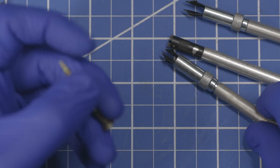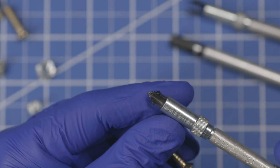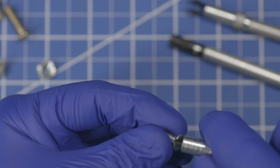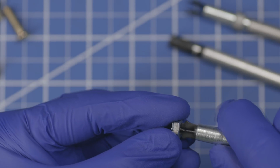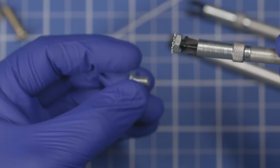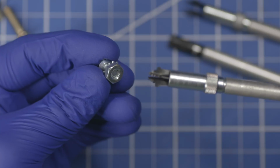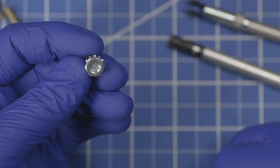That's where you want to use this design, which, as you can see, is stepped. And this is a screw and nut starter, because that step design both allows it to grab in the head of square drive screws, Phillips head screws, as well as grabbing onto these small nuts. And it grabs pretty tightly. And as you tighten this, and like I said, these aren't designed for driving them down to torque, but as you drive it in, obviously the bolt or screw pushes this out of the way, and it's left somewhat threaded, which is exactly what you want.